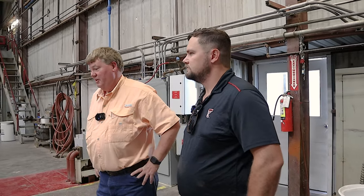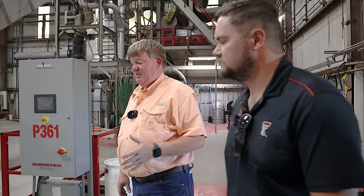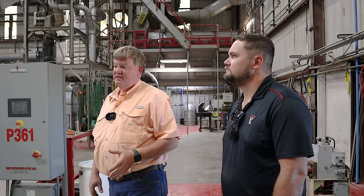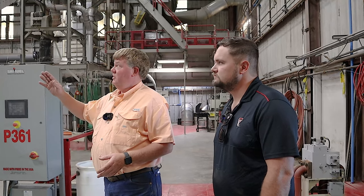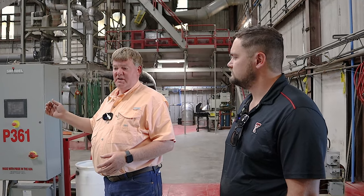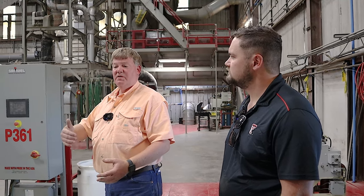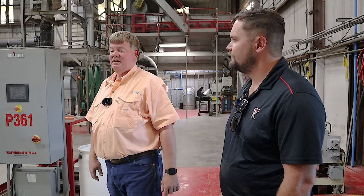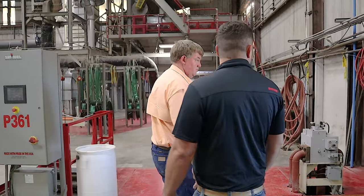Okay. At this point, the fascinating thing to me, I mean, this press, I wouldn't necessarily say it's the latest, greatest thing out, but it is pretty top of the line. It's a Lummus HSVS, which is high speed variable stroke. The tramper adjusts itself. The pusher adjusts itself, depending on how big of a charge of cotton. If you're putting in a huge charge of cotton and it's having trouble, it'll speed itself up. If it's slow, it'll slow itself down. So everything is trying to maximize pressures. But the most interesting part of this whole press is the pump.